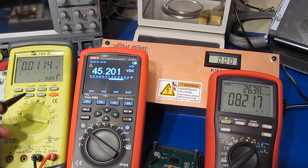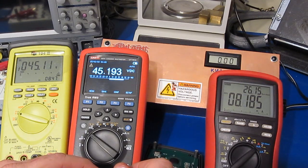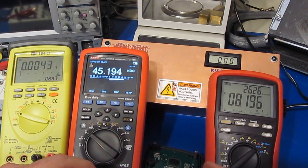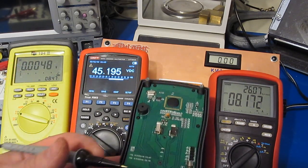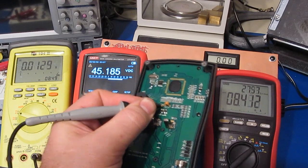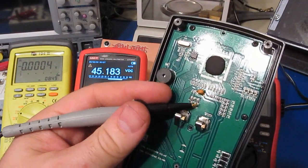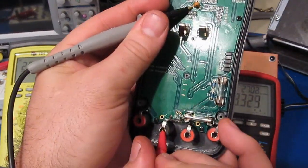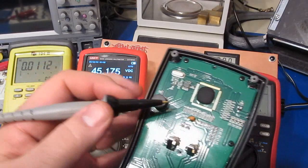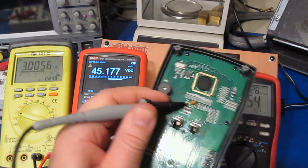You see I've got our TP194 hooked up. Again, this is currently set to DC volts mode, and you can see the meter still works fine. It does have some leakage problems in the resistance mode or something. This meter was damaged when I hooked it up to the 230 volt supply, of all things. So when I have the meter in the off mode, again we're drawing roughly 8 milliamps right now, you can see there's roughly 3 volts across our 2 clamp transistors here. And I'll bet you if we are in the millivolt range, yep, you'll see the same thing. Of course, there's our 3 volts.